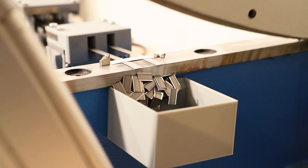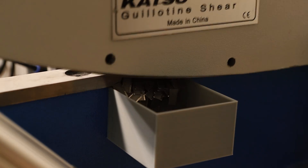From a functional point of view it was okay, but it was huge, bulky, and not very safe to operate — because there was this big shear cutter and I had to constantly make sure nobody could come and touch the blades. Also, in the beginning I used two large air cylinders and they consumed too much air, which caused our air compressor to constantly switch on and make a lot of noise. So I decided to take this machine, keep all the working parts, redesign it, and make it smaller and more reliable. Once it's built, I also want to make it easy for someone else to operate — I'll explain how to use it and delegate this work so I can spend my time on other jobs.